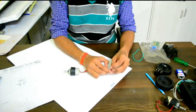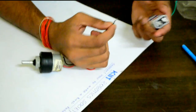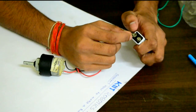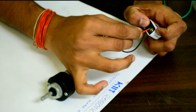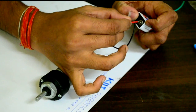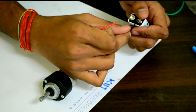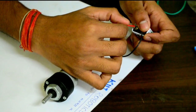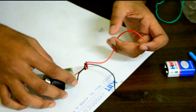There is an important concept: how does the motor move? This is a 9-volt battery. If I connect the battery to it, the motor moves in one direction. And if I change the polarity of the battery — the power supply given to it — then it moves in the reverse direction. This is how a motor's polarity and motion is controlled.